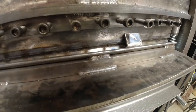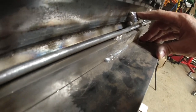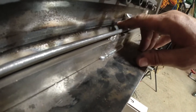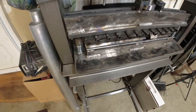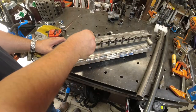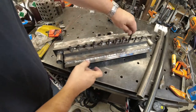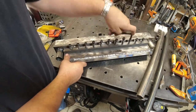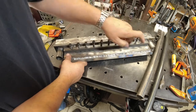As we're bending, what we're bending just hits the finger, so we need to build a finger with more clearance. As part of that, we're going to put new pins on this so it can get more height. I've built it with all these screws so that eventually I can build some more fingers for this, and that way if I want to use a segmented finger to bend around things, I can.